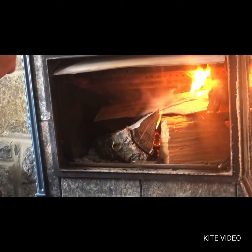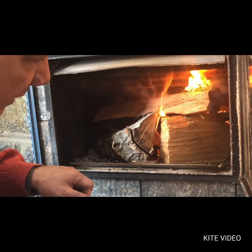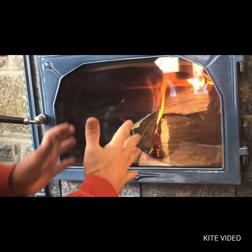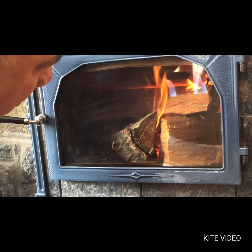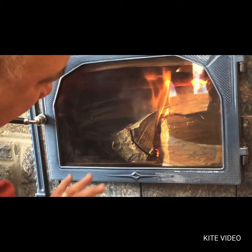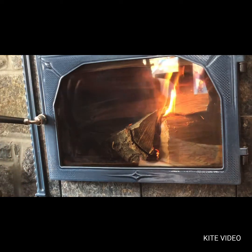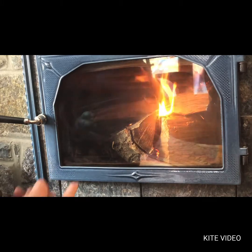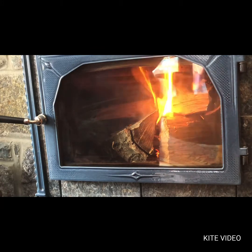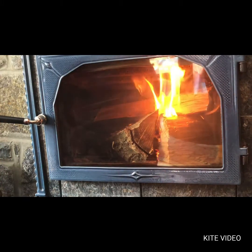And then the other thing that's really important is when you first start out, put your air inlet on high. So that when I do shut the door, sometimes that actually helps even more because now the air is going right into that triangle, shooting right in because I put it on high. So once you get it lit a little bit, the air is gonna jet in there in that area where the fire is the strongest, and you could just see the fire now starting to come out of different areas there. Before, the air was coming in from all places. Now it's concentrated right into that triangle where I created a nice, almost protective area, and you could just see that the fire is really appreciating that oxygen and the new air coming in, and that fire is lit. I mean, that fire is just going to get stronger and stronger.